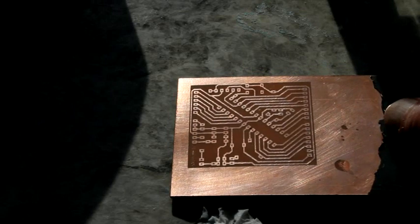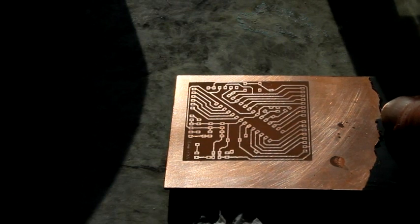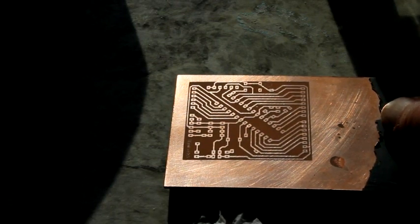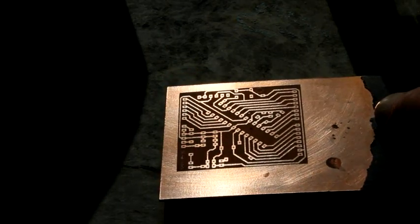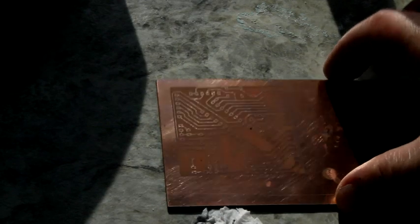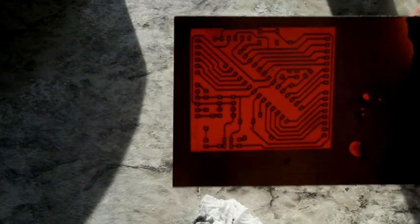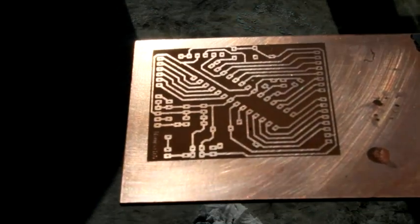And I did this by lasering spray paint off of a normal copper phenolic printed circuit board blank. It was etched using a solution of standard kitchen vinegar, 3% hydrogen peroxide solution from any local pharmacy or grocery store, and regular table salt. Now, this probably is clearly not the most efficient way to produce a printed circuit board when you need one, but it works.